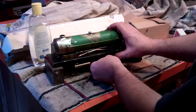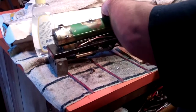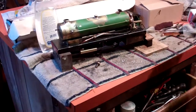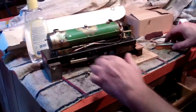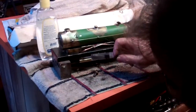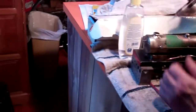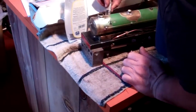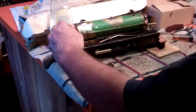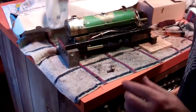The piston goes in nice — it's a nice fit. As far as the rest of the train goes, I use a lighter grade oil for the cylinders where it oscillates. I'm going to put a little bit on each side. The water level — this here is the pressure safety valve, so I'm not going to fill this completely full because it takes too long to come up.